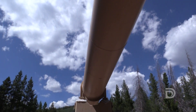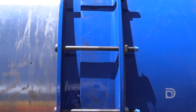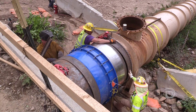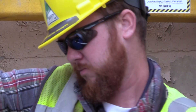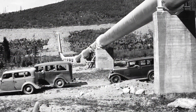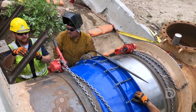The purpose of these expansion joints is that as the sun and the temperature of the water inside the pipe act on the steel, that steel actually grows and contracts as much as an inch and a half within the course of a day. These expansion joints take that expansion and contraction. In the concept of maintenance, this is what allows the pipe to last for 80 plus years. A lot of foresight and planning went into the original construction and design of these pipes in the 1930s, and it's our job now to continue to maintain them into the future.